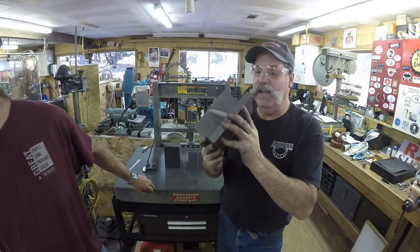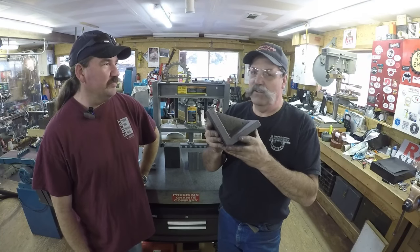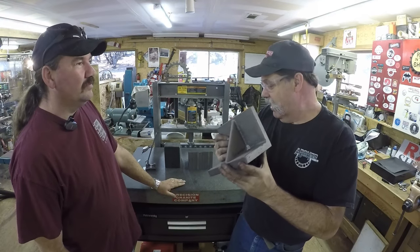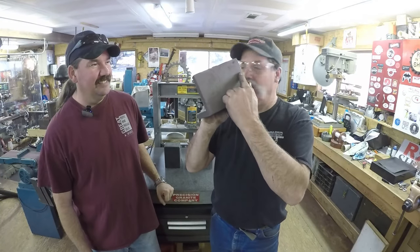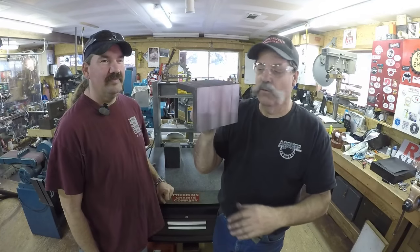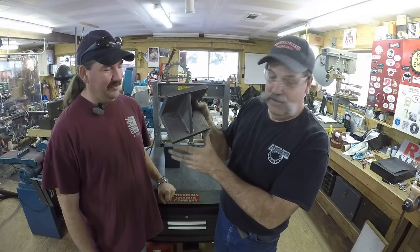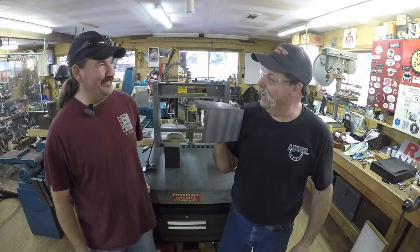These are cast iron and he's had them cast - yeah, from Sunset Ironworks or Sunset Foundry in Valley Springs, California. So he finally got them done - he just made four. Anybody wants them let me know, we can make more. These are five inches by six and a half. Anyway, these are really rough, and we just finished milling the worst one first, just in case we really screwed up - we could always take it back and ask for a new casting.